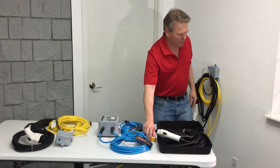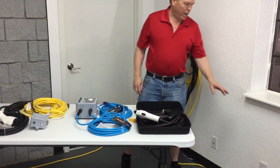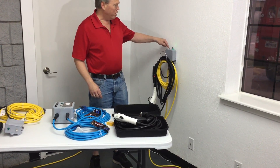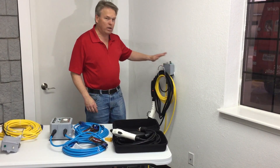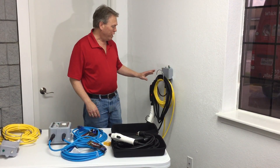To use this box, all you're going to do is plug one cord into one outlet, then go find another one. In this case, I just plugged in down the hallway. To make sure I plugged in correctly, when I push the momentary switch, I get a green light — both indicators are lit up — which tells me I'm making the right voltage and current to be able to use this.